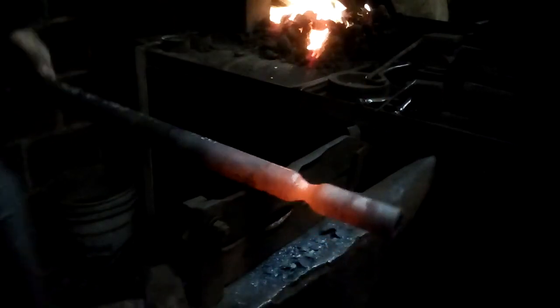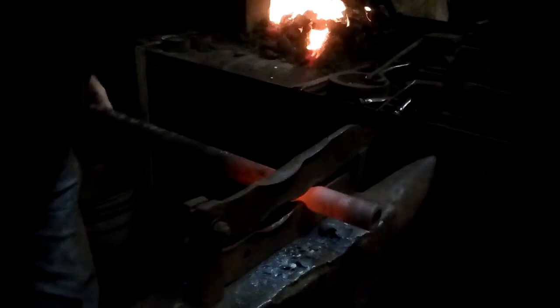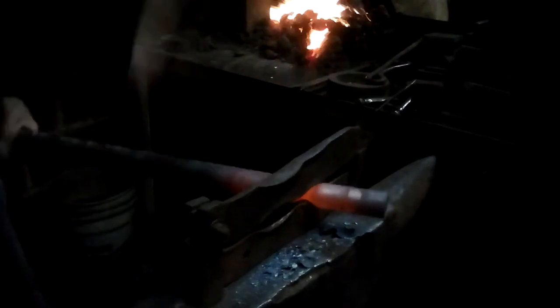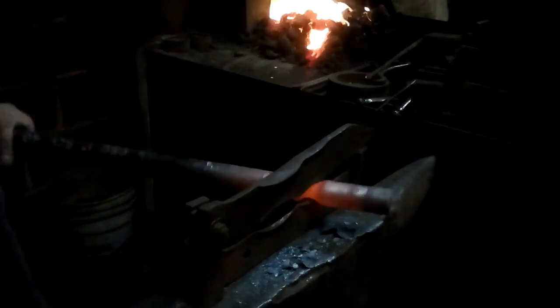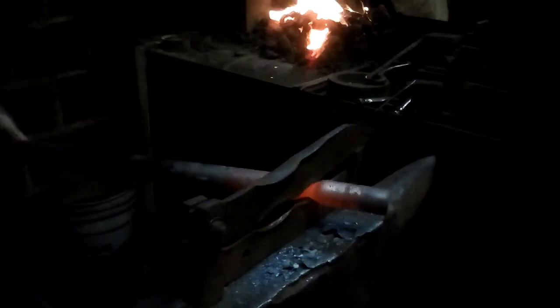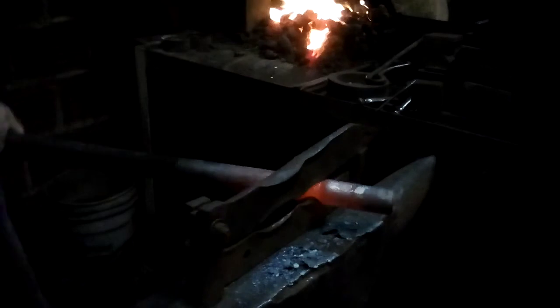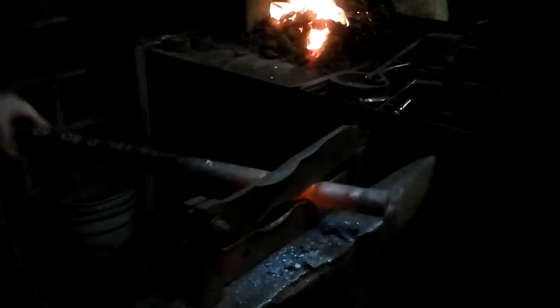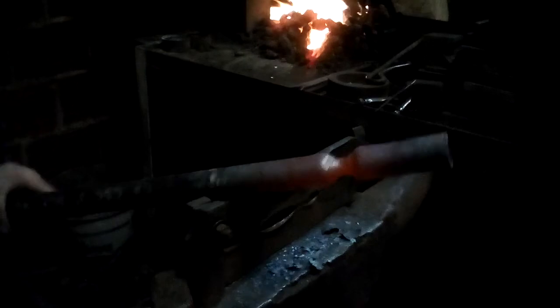You can also use this to do things like make candle cups. I've gone to the smaller radius, which helps to take a piece of pipe down even further. This is still one heat. So if you were making a candle sconce or something, you might want to make a candle holder with a piece of pipe. Now that's actually pretty cleanly done.